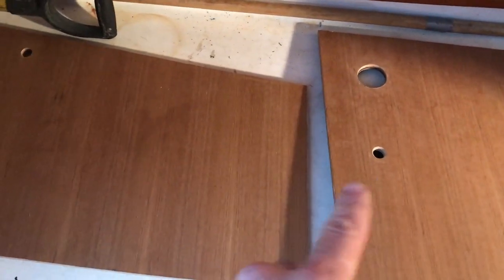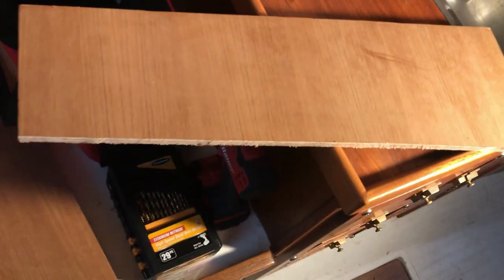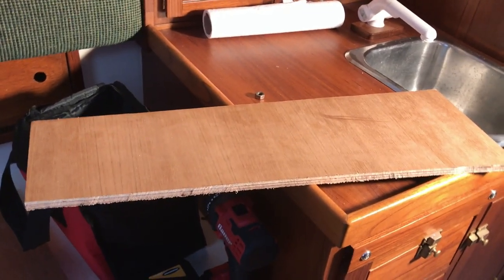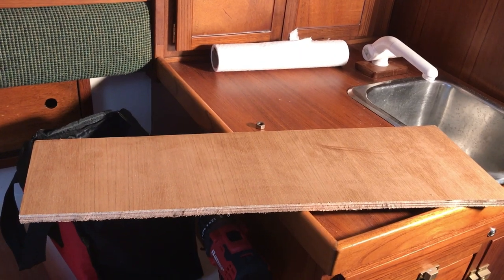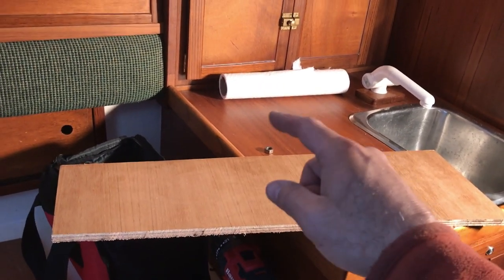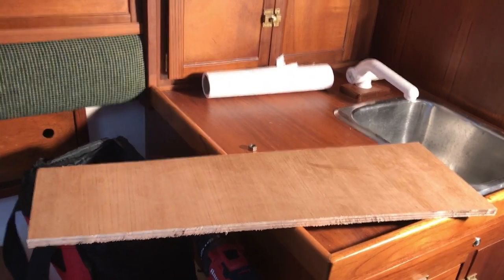That went relatively well. I cut the shelves from half-inch two-faced teak plywood — top shelf and middle shelf — with holes for the water tank vent and the tank fill. This is all I had left from a quarter sheet, and it's just right for the hinged opening part of the bottom shelf. For the remaining piece I might use regular plywood with some teak veneer I had planned for the galley but didn't use — since it'll be hidden away, it won't matter much.